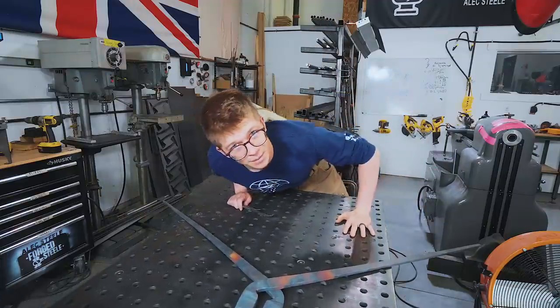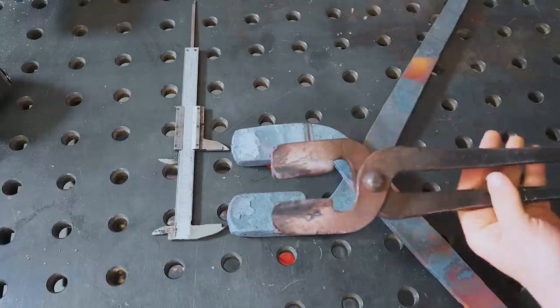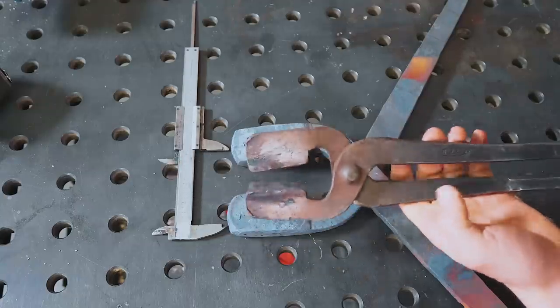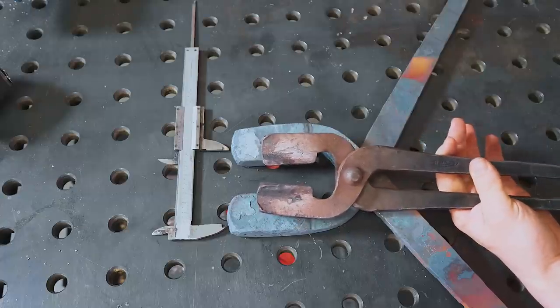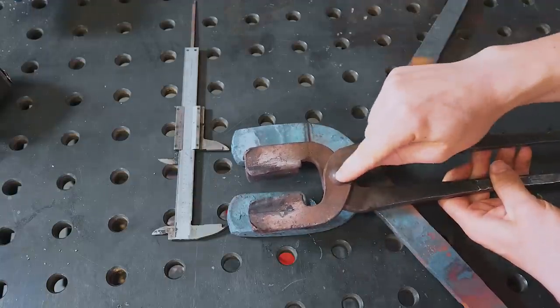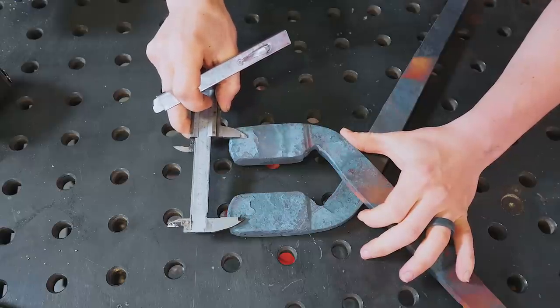Good morning. I'm back. I'm now going to work on working out where we need to bend. You might tell we're trying to make these similar to this style of tongs from Steve Howell of Ballad Forge. He gave me these, I believe, and these are just one of my most favorite tongs ever. I love them. So you'll see we have one bend coming up to the jaw, then we have a pivot, and then one bend for the rings.